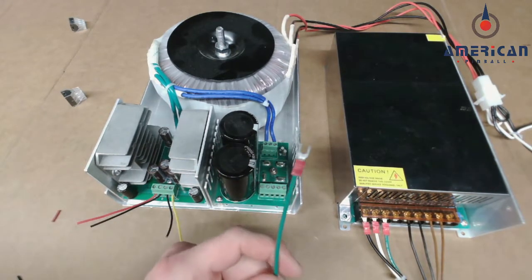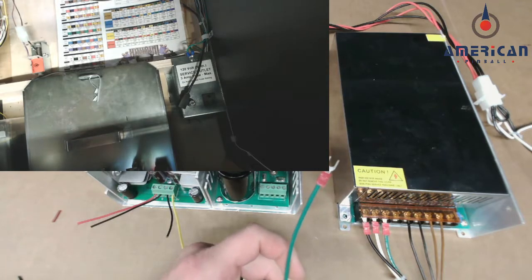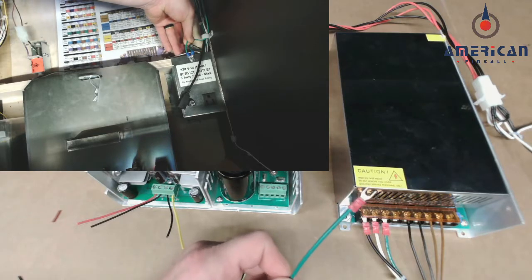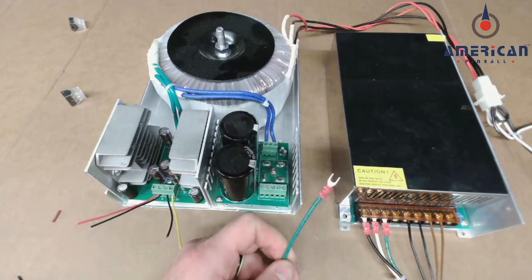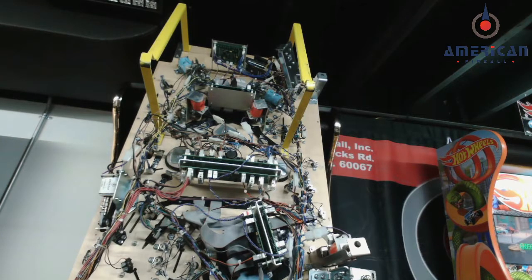The last step is connecting your ground wire. This leads up to the power box at the very front right corner of the game. You'll see another green wire there — add this one under the same screw. Now, since we're on the subject of coil power, there's one other upgrade you can install that will give your coils a little extra power during times of heavy usage, such as multiball.